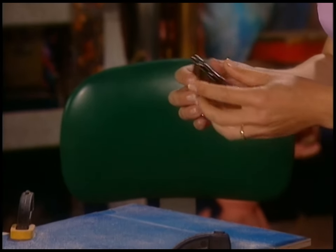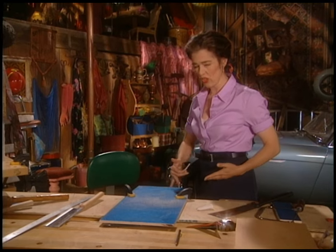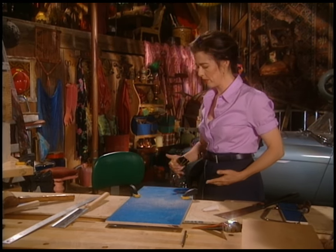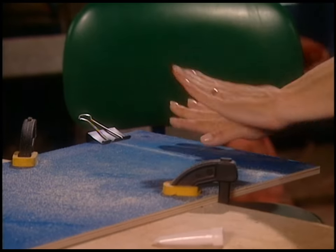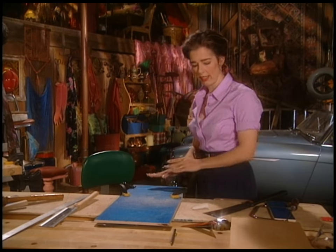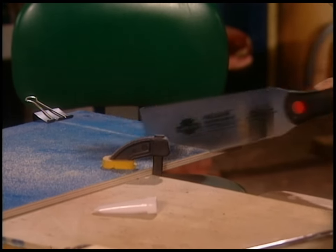You've got a binder clip at home — the wood's dropping and my saw is binding, that's what that nasty sound was. So if you put this on the end to hold the two pieces of wood on the same plane, then the saw doesn't bind anymore. See, so much nicer.